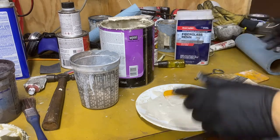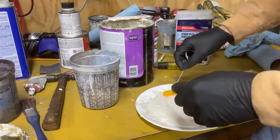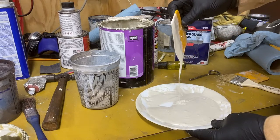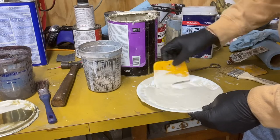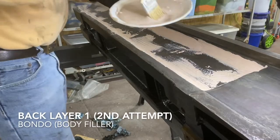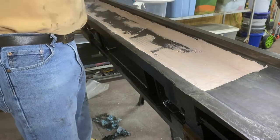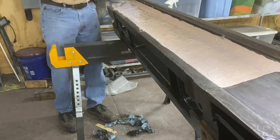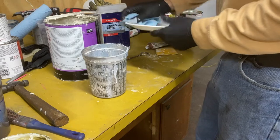I went over again with a wire wheel — even with that wire wheel you can still see a little bit in there, it's tenacious. I wiped it all down with acetone and tried the Bondo again. I decided what I really wanted was something I could paint on that would just flow in but then harden up. I thought about putting epoxy resin in, which I've done before, but it's pretty sticky, more like honey, and doesn't flow very well. So I decided I'm going to try using acetone to thin it to the point where it's runny. Now I'm going to put in my hardener. Using this throwaway 60-cent paintbrush — this is the first coat, which is a little bit better. I think I'd better stop. I like using this plate; the surface cleans up really well and it's got some rigidity.